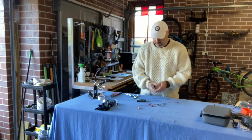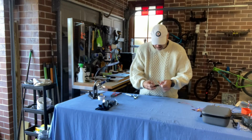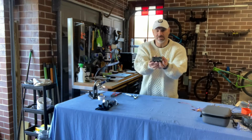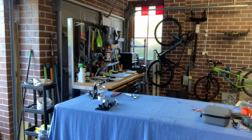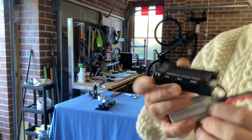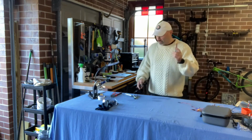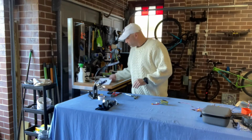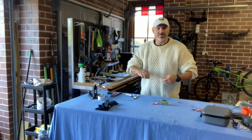So we'll disconnect that from the BEC, and let's have a look at the charge on the battery meter. And it won't even light up the LEDs on the battery meter, the LCD display. I don't know if you can see that, I'll bring it around. There you see, so it's connected and nothing. It's not even lighting up that display. So as far as I'm concerned, there's no charge left in that battery. So now all I have to do is short it out so that it doesn't allow it to build up a charge and then become dangerous when it's in some tip somewhere.